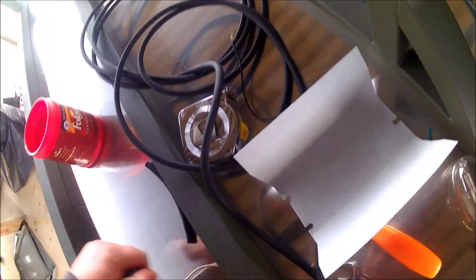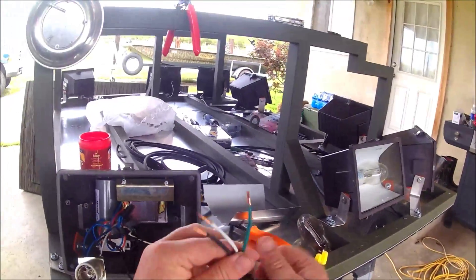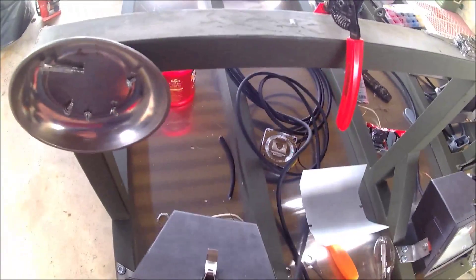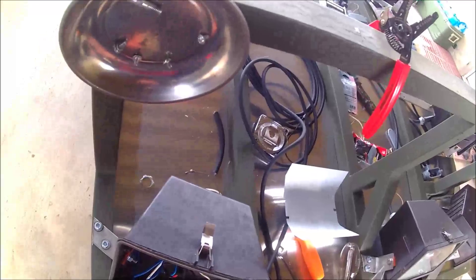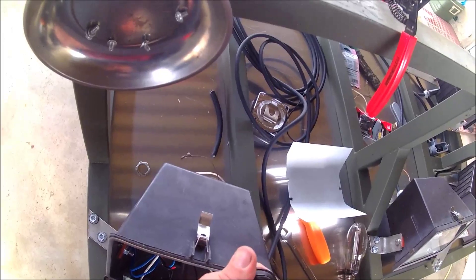We want to remove these wires, which can be stubborn. Now that we've got those removed, I'm going to pull them through the hole. Then we're going to take our new wires, which I've stripped off about six or seven inches of sheathing on the ends - we need to run it through this thing. Don't worry about kinking up the wires; it's copper, it'll straighten back out. You've got to force them through there a little because it's designed for a smaller wire.